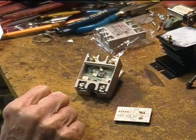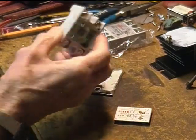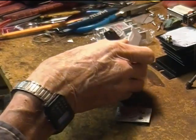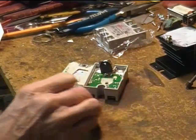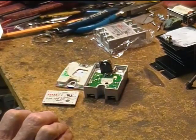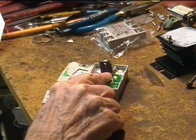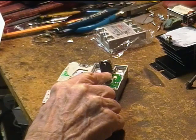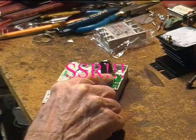I realized that the output device must be located underneath the PC board. Here is the switch — it isn't even a MOSFET. It's a C4110, which is a 25 amp BJT. A 25 amp transistor in a 100 amp solid-state relay — not cool.